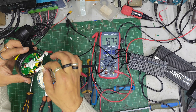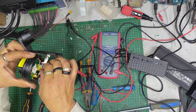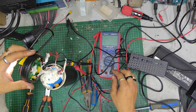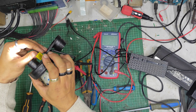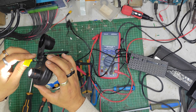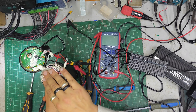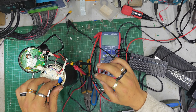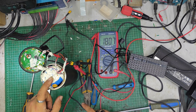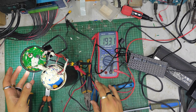The light won't work yet because it'll be running off this connector just here. Off goes the light — there goes the light working. Turn that off, the light stays on, indicating there is some battery power, but probably not a lot. I shall leave it for a bit, monitor the temperatures and see if it starts to get warm. Because if it does, obviously it's not the kind of battery we can really count on. But that might have revived it — we don't know what voltage it was at. There's no chance I'm going to get this pack out without really damaging something inside the case.